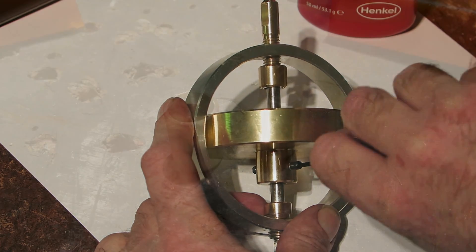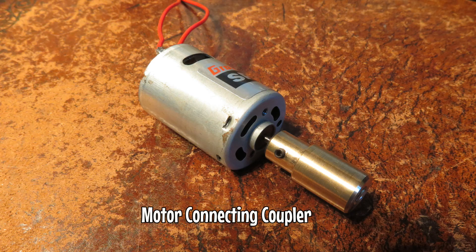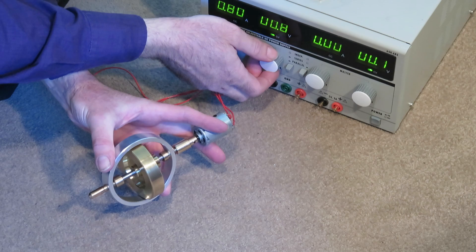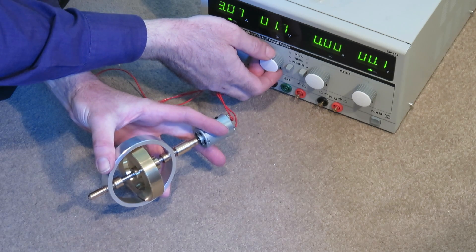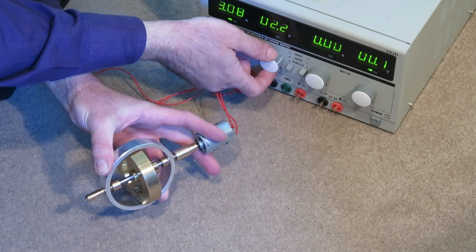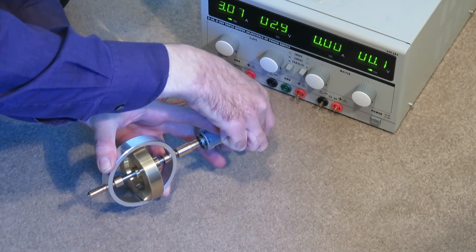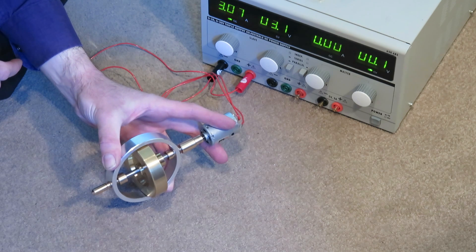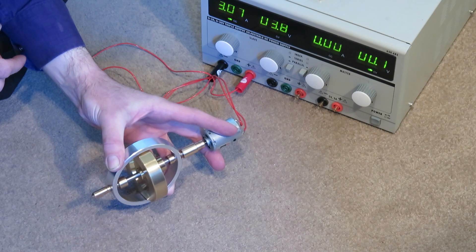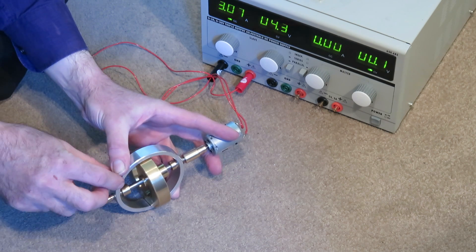So I'm going to need a way of spinning it up, and I don't think a bit of string is going to get it fast enough. Instead, I've made a brass key, and that's fixed onto the end of an old model plane motor. The wheel's actually quite heavy for this little motor, so to stop burning it out I'm using a constant current power supply. As the wheel gets faster it needs less power to keep it going, so you can see the current stays at 3A but with increasing RPM the volts are going up.